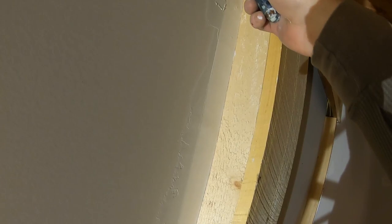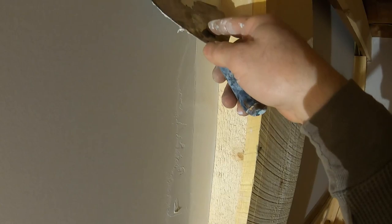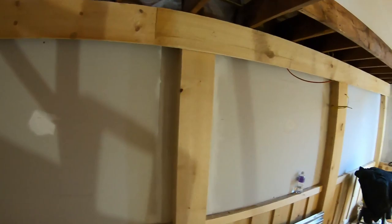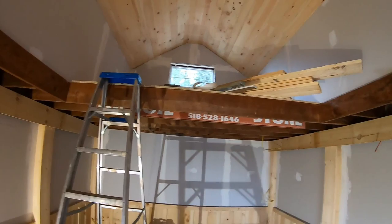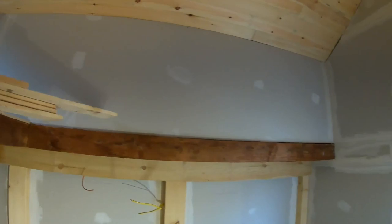Nice and easy, just to set that mud. See how nice that's going to look — run it right on up. We're going to have wood from here in there so up here doesn't matter. If you get a little bubble, put a little more mud under it. Squeegee it out with a little more pressure. That's your first pass on tape — it's going to look awesome. Got the heat pumping. Everything's flat taped down in the whole bottom level, all the way around. Getting on the ladder now to do the peak. Everything is taped, first coat. Got all the outlets in, corners all done. Everything's looking good — crank the heat up and let it dry until tomorrow.